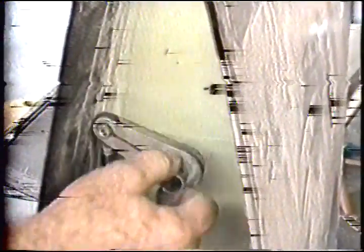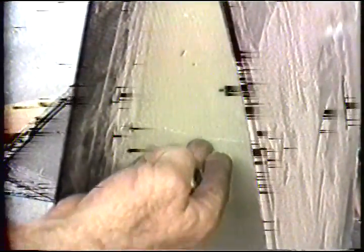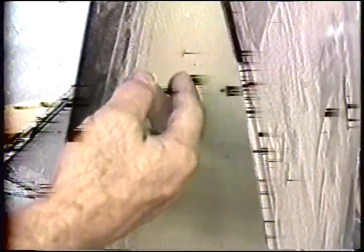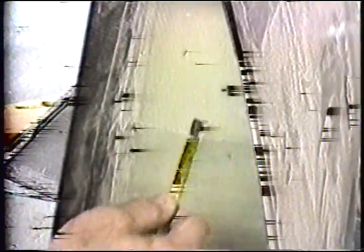It can float as well, as long as the position you choose, you see these 2 holes here, represents the bulkhead that isolates this aft bay from weather. This aft bay is likely to get water in it because its outboard end is open to the weather at the aileron torque tube. Any water that enters that bay drains at this point after the bulkhead. So anything after this bulkhead that clears the torque tube is okay.